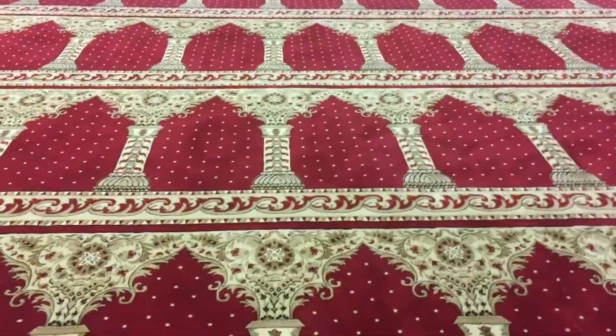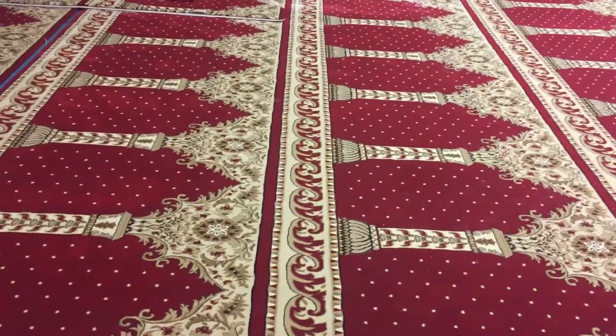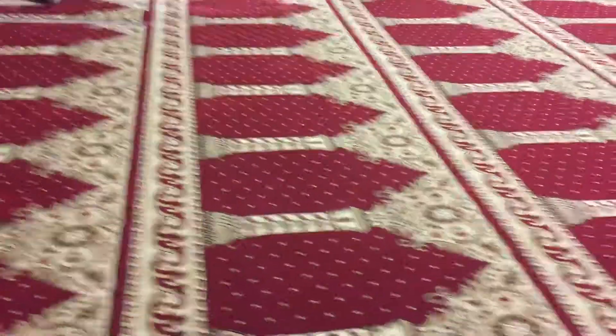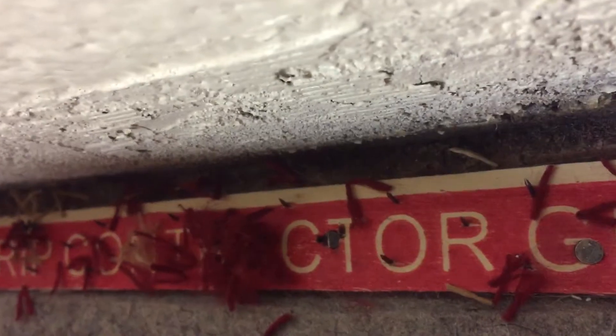There were rolls of carpet that were put out. There's a roll after every eight feet, and this is where the seam is. The only thing left to be done is tucking the carpet in and stretching it. We will be back — this is where we will be stretching it and putting it into the tackless, and these are special nails here which will hold the carpet in place, inshallah.